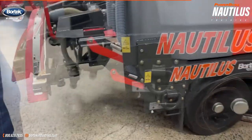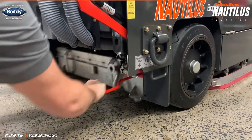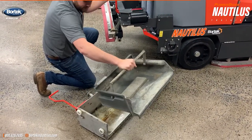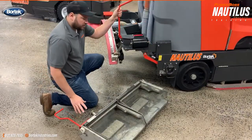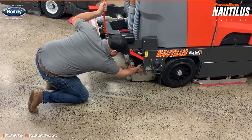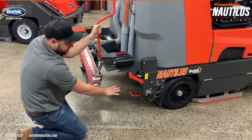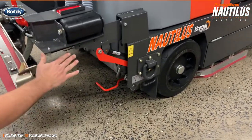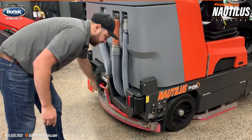We're going to lift up the rear squeegee. The debris trays are underneath the machine, and by pulling on this orange handle, the entire tray will come out. This is where all the debris and sediment from the day will be. You can lift these bins out and take them right to a garbage can. If you have a spray hose available, it is nice to clean this out daily. After you've cleaned out your trays, put them back in — this slides right back underneath the machine. Get it lined up so that when the door shuts, it'll push the trays back up. There is a safety latch, since this door is quite heavy, so it doesn't fall while you're reaching underneath. Lift up on the squeegee, depress the safety latch, and shut the door. Everything is back together.